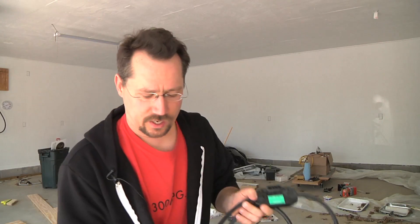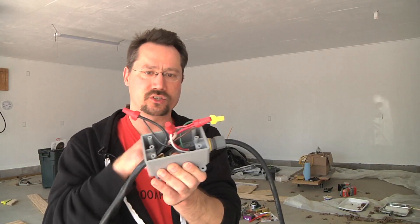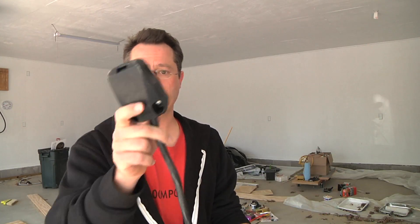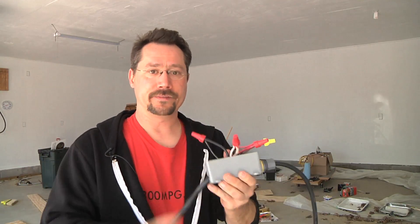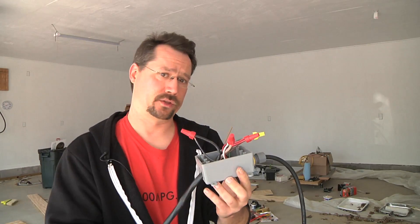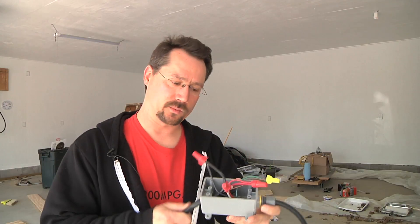What I've done here is on the other end I have an open junction box with the connectors spliced together, because I've built a test rig. I wired on a NEMA 14-50 connector because that's what I already have in my garage for 240 volt power for my electric car charger. This means I can plug the micro inverters into the connectors and then directly into my wall, run that through a 240 volt circuit breaker so I can turn the system on and off. Leaving it open also means I can get my clamp meter in to check how much current is running through the system.